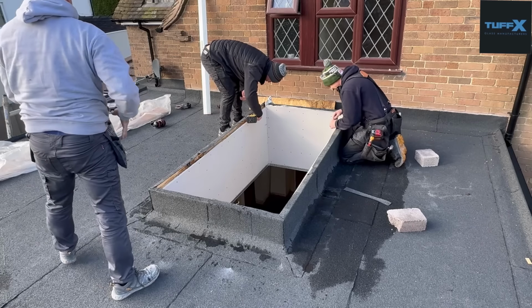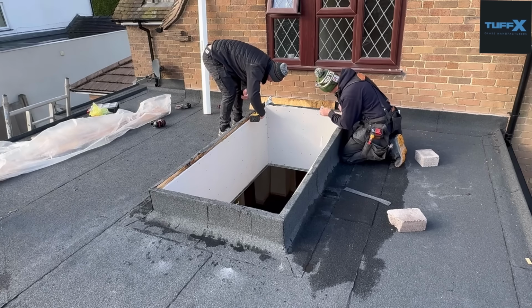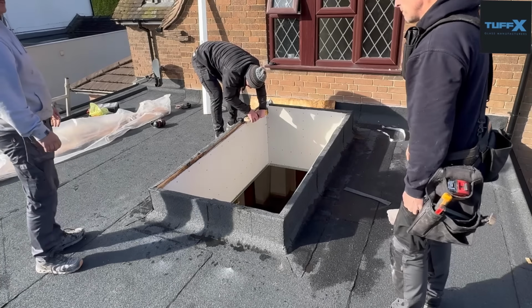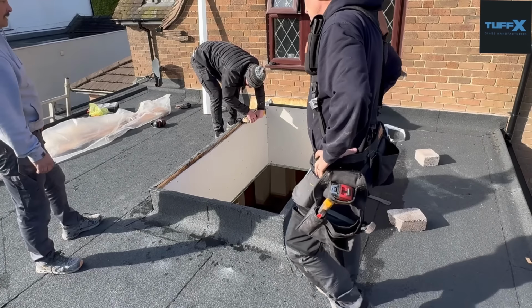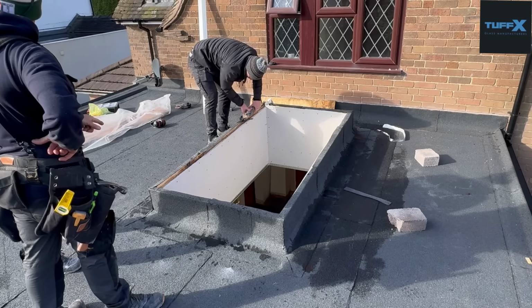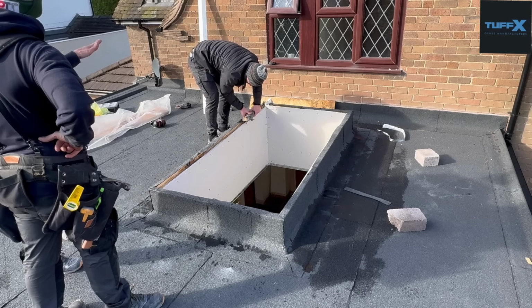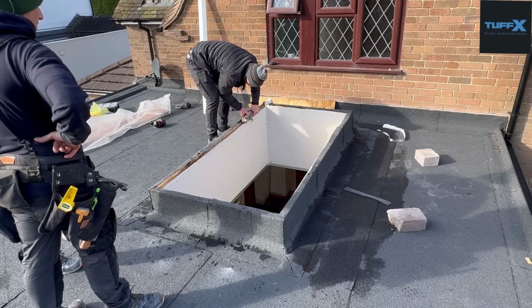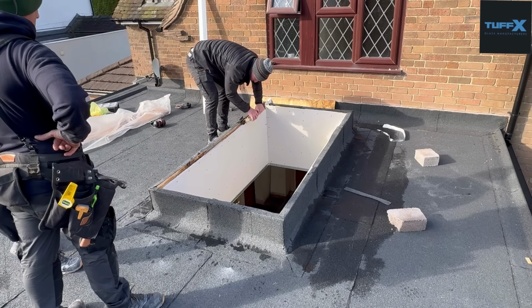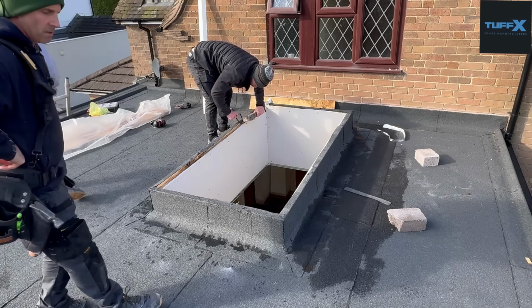Yeah. It's right. It's only a little, you know what, I might even go and get my rasp on it. Bit of a raspette. Maybe. Just flush with the timber, and then put the bead on top to give you your 2mm back up again. Yeah. Let's do that. I'm going to get my rasp, I'm going to get my snips, pass the beads up. Okie dokie.